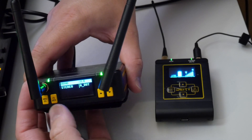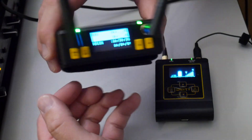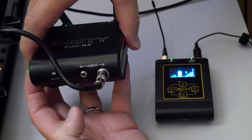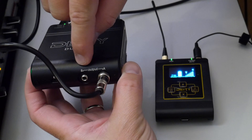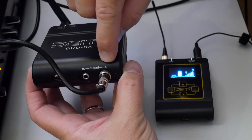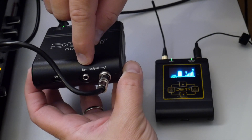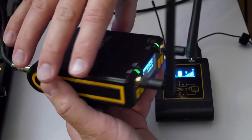Under Output Level, you have Output Type where you can select mono or stereo. Going into mono, you have two selections — XLR or DSLR. If set to XLR, both A and B go straight to XLR outputs with independent level control for mic 1 and mic 2. If it's set to DSLR, you only use the A output to go to your DSLR camera — mic 1 on the left channel and mic 2 on the right channel — and the B output becomes a headphone monitoring jack with mic 1 in the left ear and mic 2 in the right.